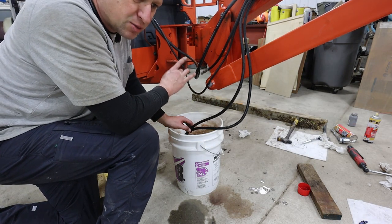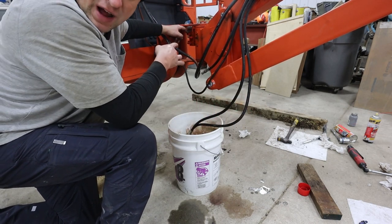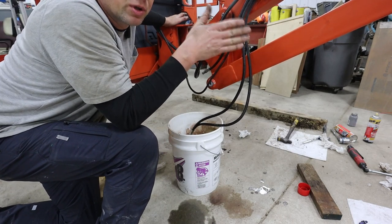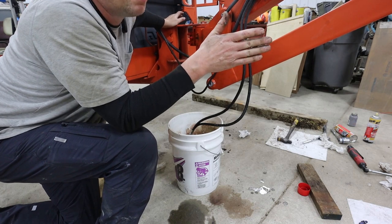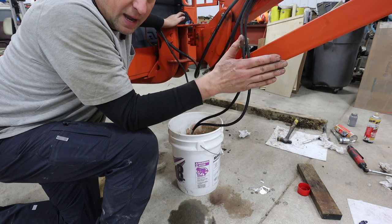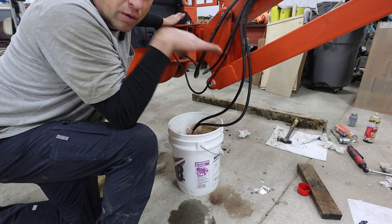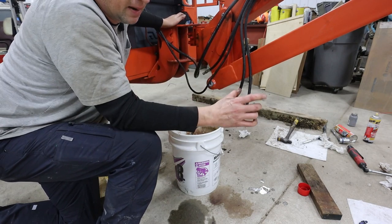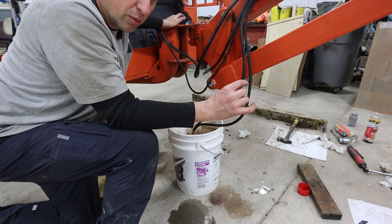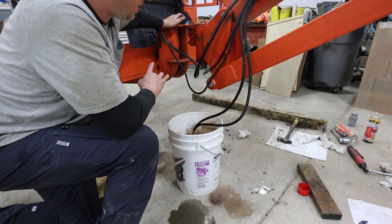I'm thinking that that is probably supposed to be controlled by an overpressure valve in this valve block. So it should really stay where it's put, but I can't remember what they call that, but it's like a back drag valve. And if you try to put power into it, like on a drive motor, if you were rolling down a hill or something, it would attempt to break that hydraulic flow, but it would open up after a certain point. So I'm wondering if that's something that's happening here.